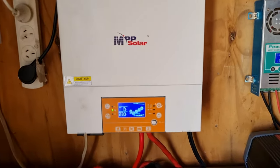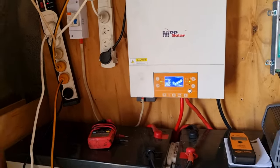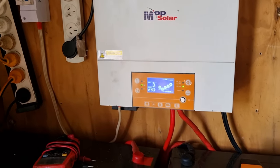The issue I had to figure out is that this system requires 120 volts before it can draw any watts into the system from the panels. I did not know that, so on an overcast day we weren't getting any power, which was really frustrating.